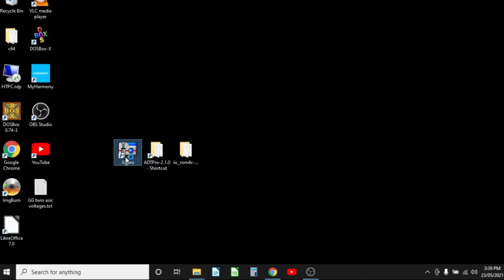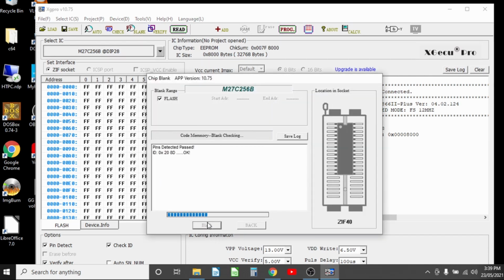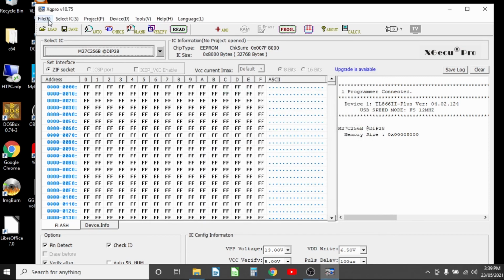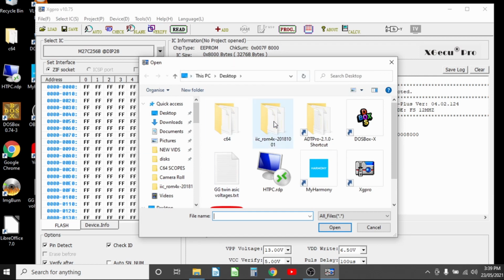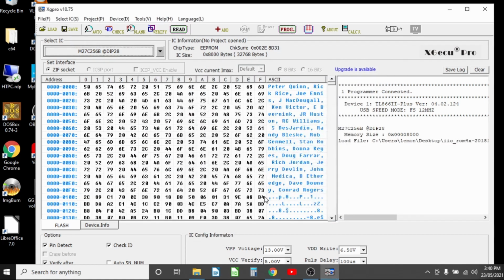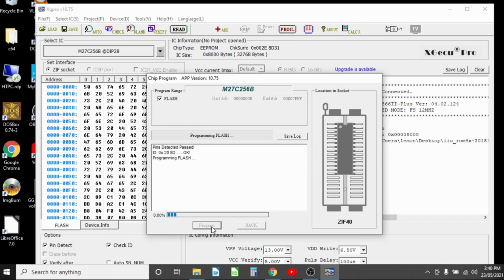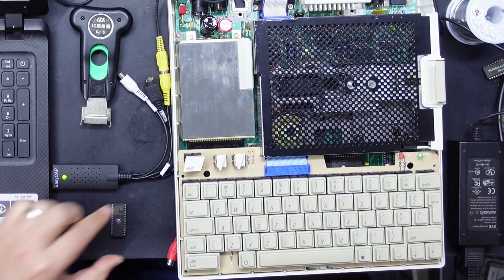So after that, we'll fire up the Mini Pro programmer and I've already got the right IC set up there. We'll just do a blank check. Make sure EEPROM is nice and clean. All right, looks good. Let's load this file in, which is somewhere right here. 2C ROM4X. That looks good. Let's program. And then we wait a moment. Cool. That's done.